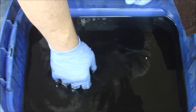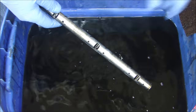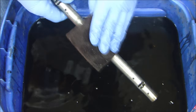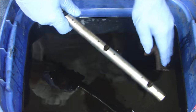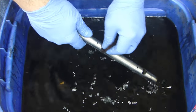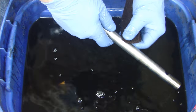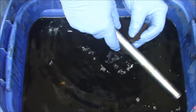Let's see how our parts turned out. You want to get yourself some nitrile gloves. The first shaft is pretty clean. What I have here is just a Scotch-Brite pad — a red Scotch-Brite — and I'm just going to use that to polish off some of the more baked-on parts. The question is, how clean do you want to get your parts? I get them as clean as possible without destroying the integrity of the part — meaning I wouldn't clean this with sandpaper or anything that will destroy the base material. I just want to get it clean enough so when I go to reassemble it, it will assemble easily.